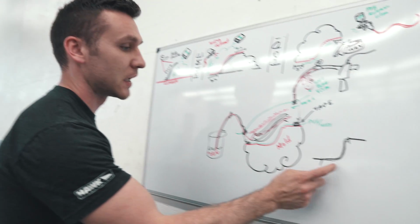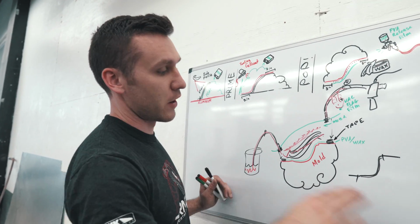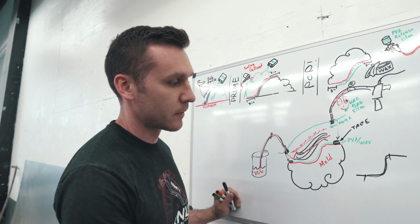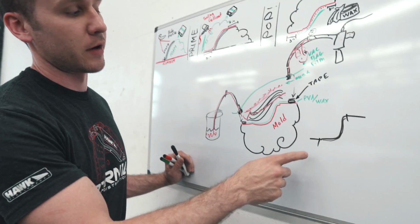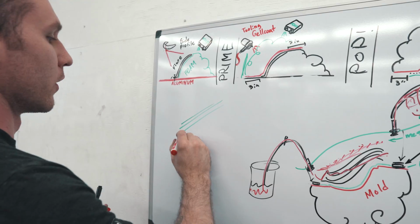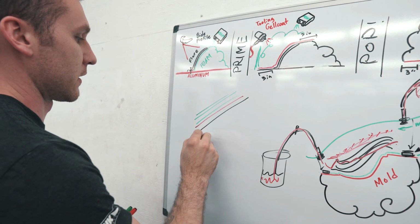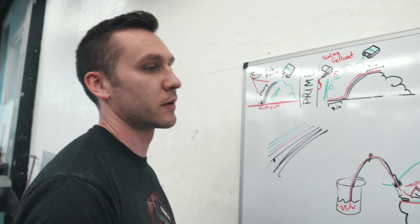So that's why even with a lot of people that make carbon fiber, if you're going for full race dry carbon fiber, you're not going to use the gel coat, sorry, because all that does is just add weight. It's not really going to help you at all. But most carbon fiber pieces you buy are actually like 3 layers of like fiberglass, 1 layer of carbon fiber, just so it looks pretty, and then a layer of gel coat. And that gel coat, they say is UV resistant, but not. But that's why we always clear coat it.